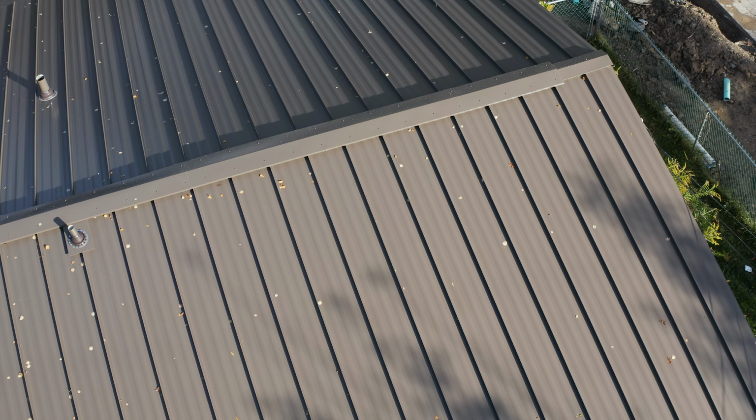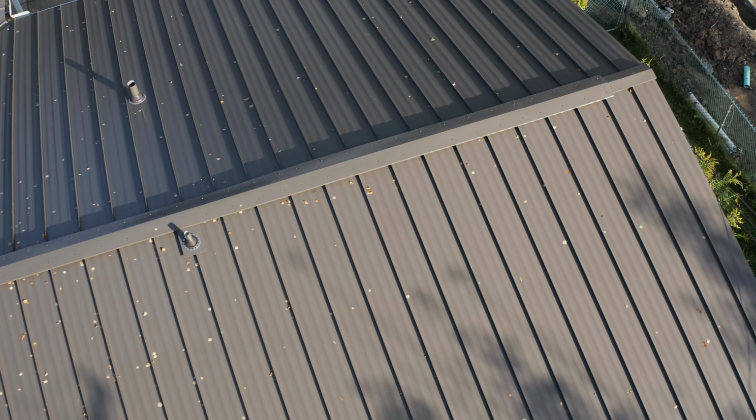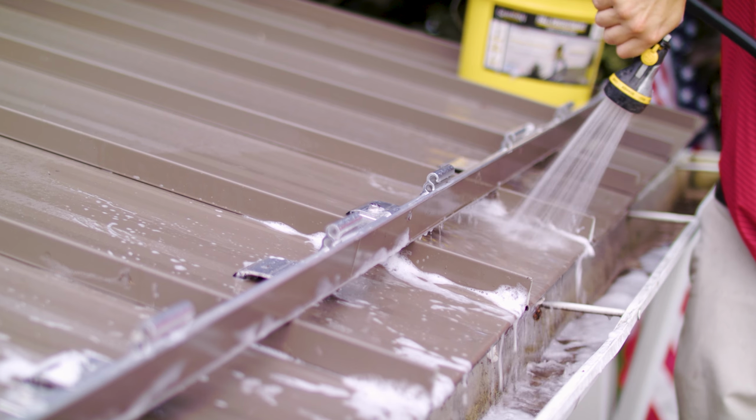What haven't we covered in regards to replacing versus repainting? I think there's considerations that have to start with the safety of access, right? You start with safety and understand, okay, who am I letting up my roof and how safe are they going to be in doing that, right? There's a major thought process that needs to go into how are they going to access this work and how are they going to do it safely. And that's just for everyone's protection along the way. And then past that, there has to be consideration in how to clean and the cleanliness of the roof itself. And then you move to surface preparation and then ultimately, like I said earlier, coating selection.